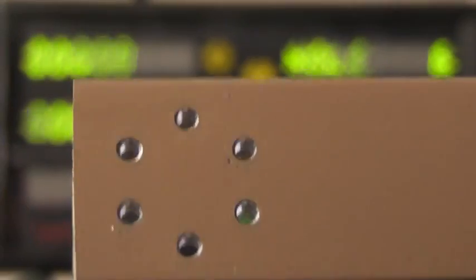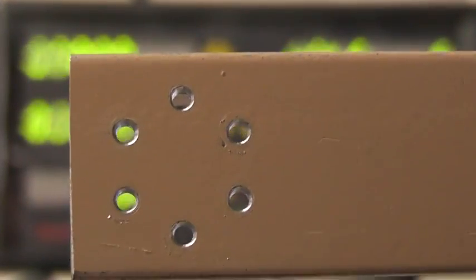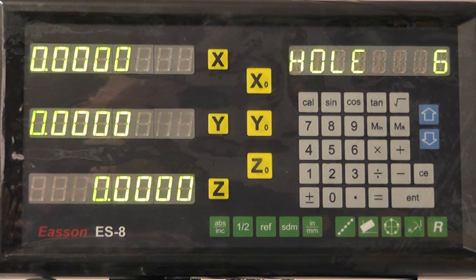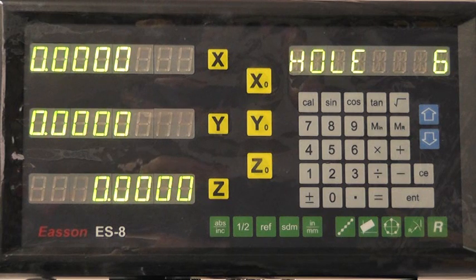Go ahead and pull that off and give you a look at the final product — six holes laid out on a three-quarter inch diameter bolt hole pattern. Pretty simple to do if you have a digital readout; I would definitely suggest learning how to use it. It's much easier than doing all the trig by hand, and it's a nice accurate way to do it without a lot of thought — you just need your diameter, your starting point, and how many holes. If you have any questions or comments, or things you'd like me to make videos of, put them in the comments section and I'll get to them. Until next time, take care.